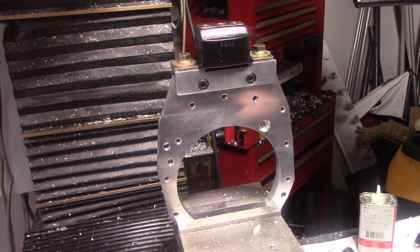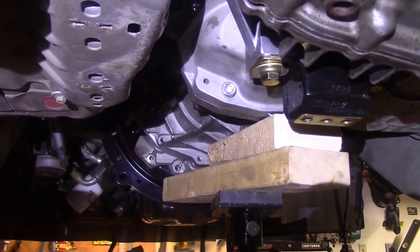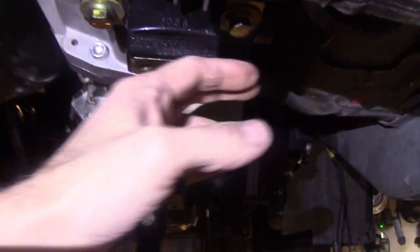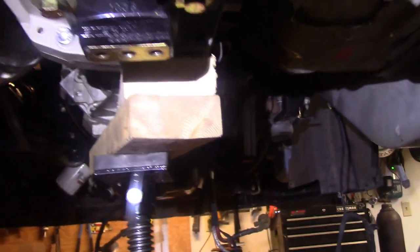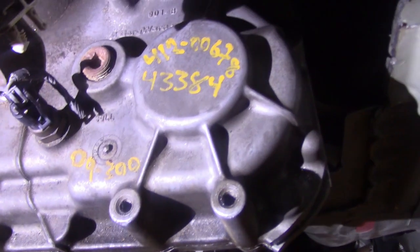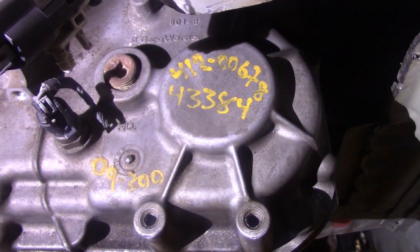And away we go. And here's the final result of all this work. You can see we're looking at the back of the transmission in the power tunnel. As you can see, the transmission mount is sitting horizontal, taking into account all the various angles. And as I mentioned in the last video, I had made a decision to actually angle the transfer case. It's now 10 degrees off of horizontal, which dramatically reduces the amount of intrusion into the inside of the car, and should make the bump in the floor even more minuscule. I think it was the right call.